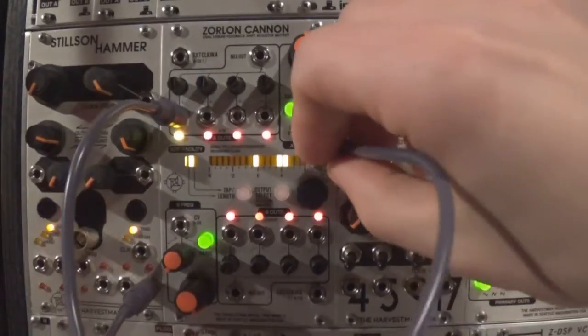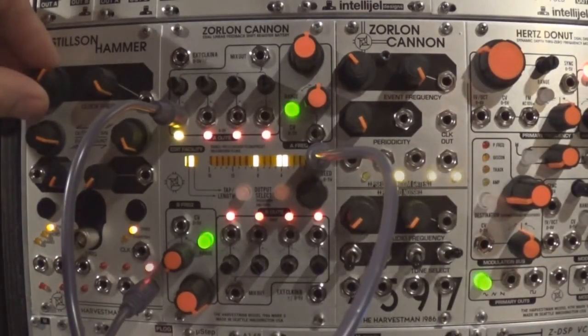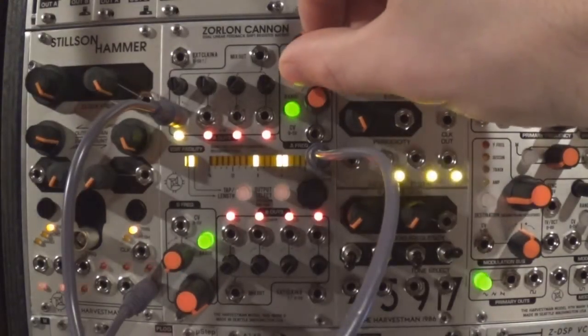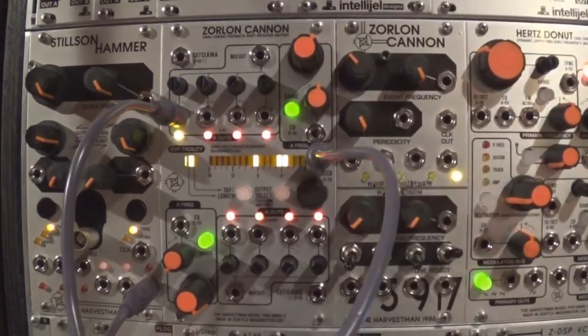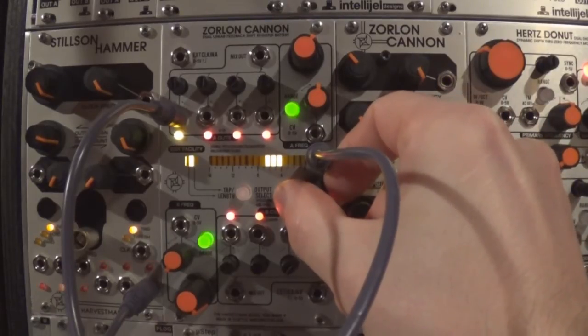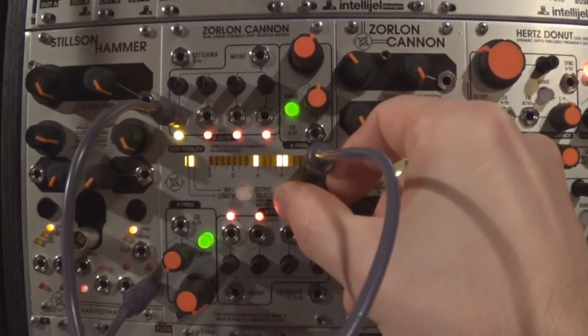The seed input offers interesting possibilities. Shorter shift register lengths have a higher pitch, as they divide the input clock by a smaller number. All configurations with an odd number of taps are non-maximal. Non-maximal sequences are divided into a number of different sequence lengths, which are selected at random by pulsing the seed input. The seed input will update all 8 outputs — try creating rhythmic shifts of timbre or sequence by sending gates to the seed input.